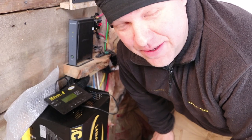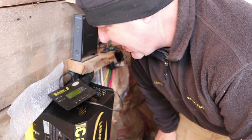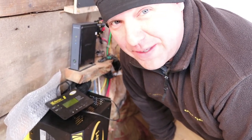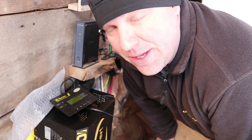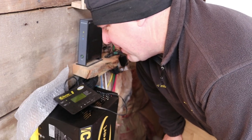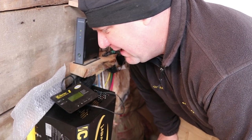We wanted to test whether there was a surface charge on the batteries, so we disconnected everything and put a load on them. We dropped all the way down to 11.3 volts in about 20 minutes. So now we've dropped the charge rate on the inverter charger to 30 amps total — we had it set to 80, which is probably too high for only two L-16s. We've plugged it back in and it does look like it's going through the bulk charging phase, though it still looks like it's going a little too fast. If you get the feeling like we're getting nowhere, that's about what's happening.